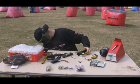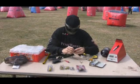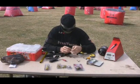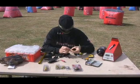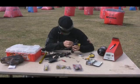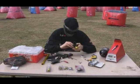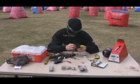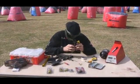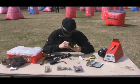Now off of our stock board, let's take our wire harness, which is held in place by a little rubber band. There we go. And let's go ahead and put on our stock harness. Now it's always a good idea, anytime you're working with these Molex connectors, you always want to grab them from the connector. You never want to grab them from the wire. It's very easy to pull the wires out. There we go.